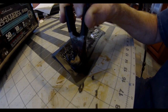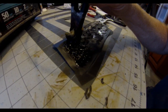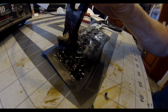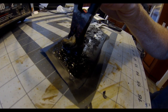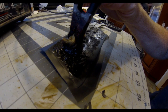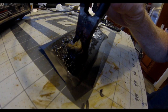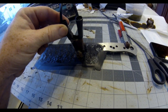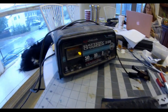You can see the moisture actually bubbles up with a little bit of heat and steam. You don't want too much moisture on that gauze — you just don't want any additional water to flow underneath any of that vinyl. You really want to control it as much as possible; it just has to be damp enough to get the electricity flowing through it. This is a fairly big blade, so this one did take quite a bit of time to etch.